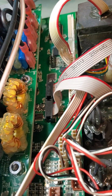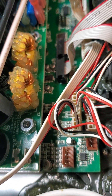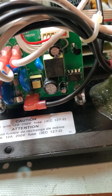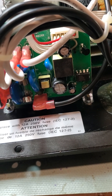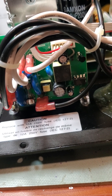It actually turned on the main board, which looks like it has a TI DSP as well as an FPGA, and that all came up fine. The LDO, or low dropout regulator, on the other side of this board takes the six volts, regulates it to five volts, and provides that to the other board as well. That seemed to work fine once I supplied six volts.